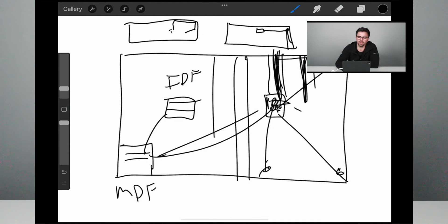To recap: it's the type of connectivity from IDF to MDF — fiber or copper. Looking at all the drop locations and thinking about the path the wire installer will run them will determine where your IDFs go. And thinking about what peripherals are hanging off this IDF — to account for the right switch port count. Once you find out the switch port count, it may change what you need back to the MDF. It really is a process of looking at the floor plan, thinking about switch locations, port requirements, and wireless requirements.